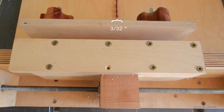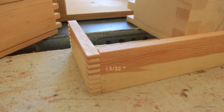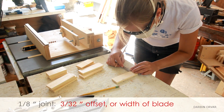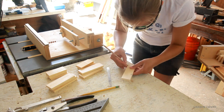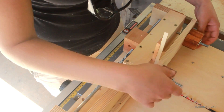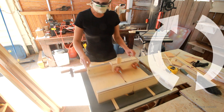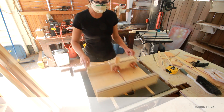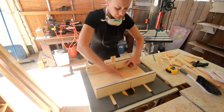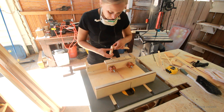It's not literally a 1/8 inch joint — it's actually a 3/32 inch joint, since that's the width of the blade. Now, if your blade is 1/8 inch, then you should make the spacer that distance. You could also measure out the distance — 3/32nds or the width of your blade — and make a mark if you don't have a spacer, and line up your pieces from there. So, set up the pieces with a spacer or your measure, tighten the knobs, and then remove the spacer. For a 1/8 inch joint, you need to cut once and then spin three times. Cut again and then spin three times, and so on. You can actually stack several pieces of wood and cut them all at once, especially when cutting thin pieces. When you're done, loosen the knobs and check if they fit — which they should if you had them placed correctly, if you counted correctly, and you made sure the handle was always in the up position after each spin or cut.